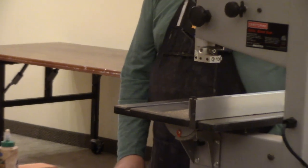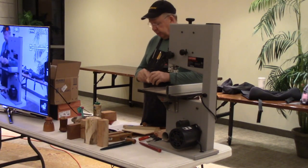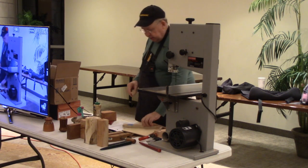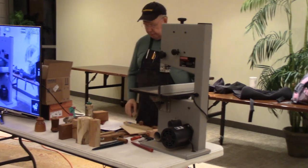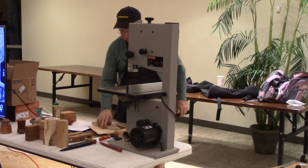It takes away all the wood and leaves you with a roughed out knob like this. Then you may have to do a counterbore to make the head of the screw fit in far enough so that it sticks out into the T. And that's how you make a knob. Sweet. Piece of cake.